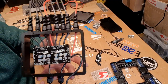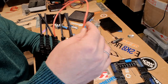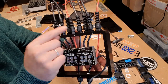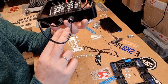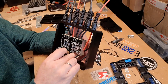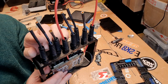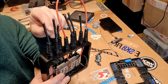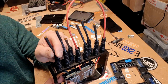Here is the rig — brand new VESC HD60. The phase cables are through and I've done just a bit of looped cable to replicate cables penetrating for the center cable to seal the holes. At the bottom, just looped out another bit of cable through the connectors where the power cable is going to go. Let's put it together. By the way — up to 5.5mm size straight connectors fit through these adapters; the only thing you have to do is take the heat shrink off. However, the original ones on Trampa VESC fit straight through.